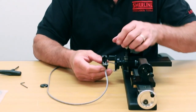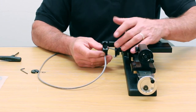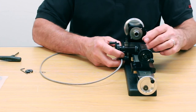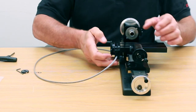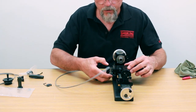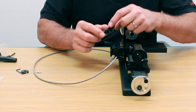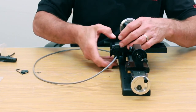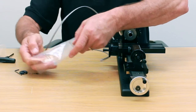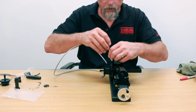If you look at the DRO housing, one side of it is thin — it just has the lip on it. The other side has a lip but with a thicker section on either side. The thicker side of the housing goes towards the thrust collar, and this lip right here is going to lock right into the groove on the DRO hand wheel. So bring it underneath, put it up in place. Then take the top housing — this is easier to assemble upside down once you get both pieces together because the screws come from the bottom. Put both halves together — thick side towards the collar, into that groove. Then put your screws in one at a time. Put them in without tightening yet — just get them started. These are self-threading screws, so if you over-tighten them you will strip out the plastic.